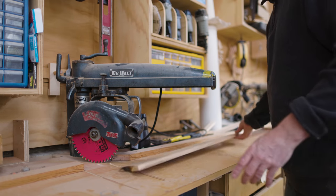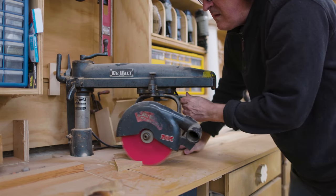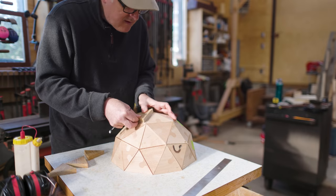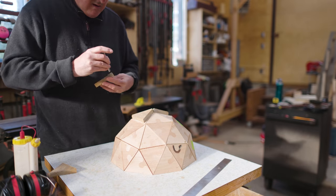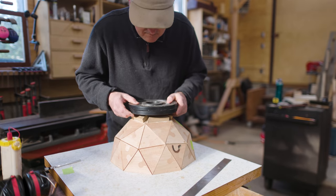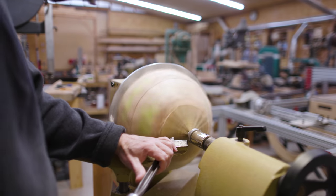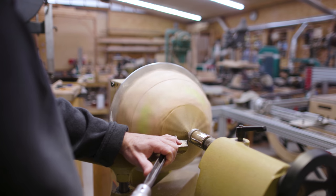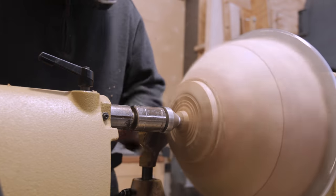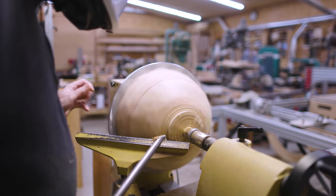Now that the hemisphere is glued together I need to make something the lathe can hold on to. I'm going to glue some triangles to the bottom of the hemisphere and this will allow me to make a tenon to go in the chuck on the lathe. So I can start by putting the bowl on backwards held with the rim and I can make the tenon on the other side of the hemisphere. That tenon doesn't really need to be solid — it just needs to be something that the lathe chuck can hold on to, and it needs to be about the right size. If it's too small then the chuck doesn't work.